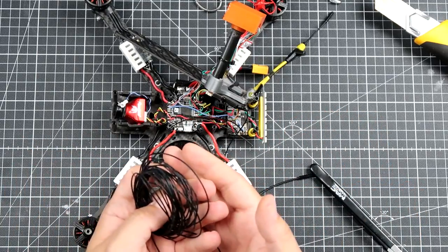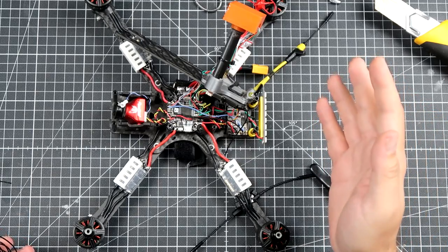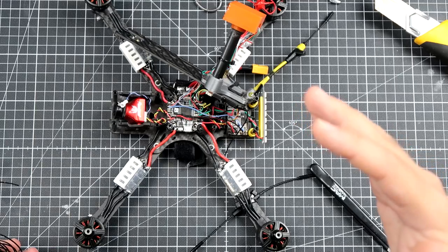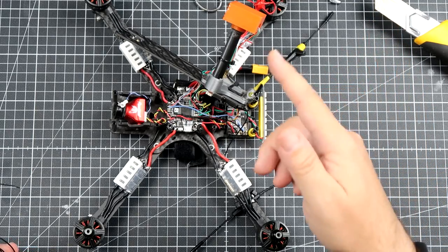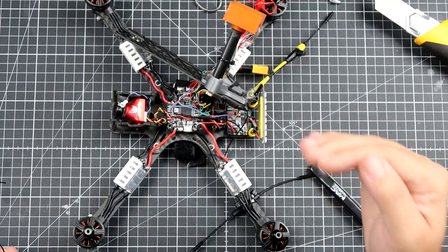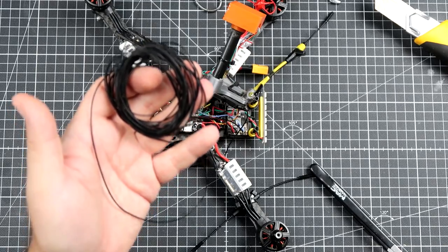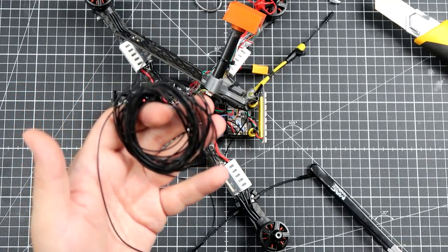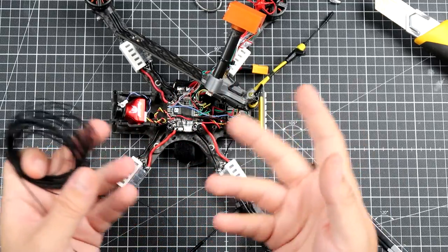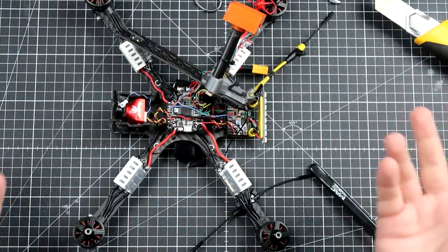The result? Super clean video. No lines, no tilted lines, no vertical lines, no horizontal lines, I always mix horizontal with vertical. Just a very nice, clean and smooth video signal. With a thin coax or just a twisted wire, which, come on, you can just take a wire, twist it a few times so it looks like this, solder, and you are done.